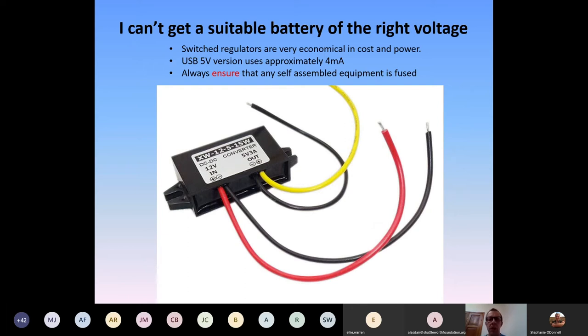If you've got equipment running off 5 volts and you only have a 12-volt supply, look for little voltage regulators. We've used these quite a bit — they'll convert 12V to 5V with only about 4mA of quiescent wasted current. They're useful for adapting consumer equipment. Always put a primary fuse in when you're making battery front-end connections — it's imperative, especially in damp remote environments.